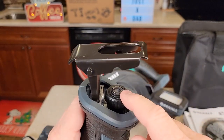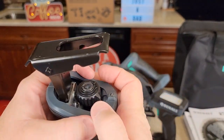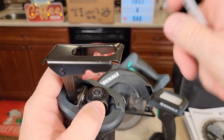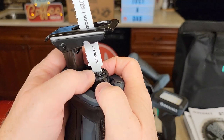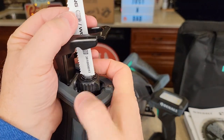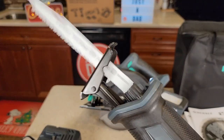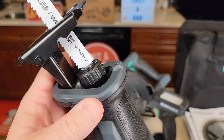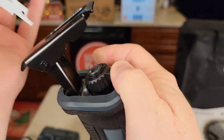Make sure you put the allen wrench back in the handle so you've got it for next time — snap it in. For the blade, it does have a quick-change; it's got a spring tension. Put the blade in, kind of get it started, rotate it — it is a little stiff — then let it go and it's in there good. To change it, just rotate that collar up and it should pull straight out.